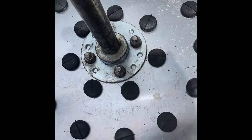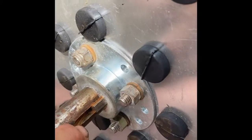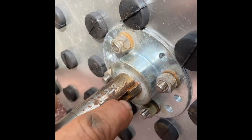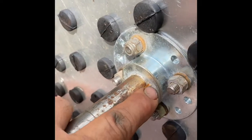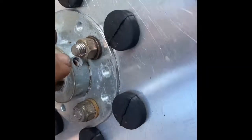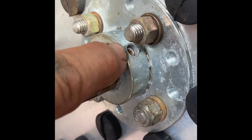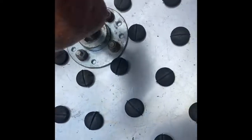I want to mention that this little hub here is a go-kart hub — I got it for $16 from Amazon. It's steel and you could weld it, but what I did was groove it with my angle grinder to put a key in, tapped it in, and then set the set-screw tight. So yeah, go-kart hub, 16 bucks.